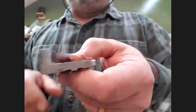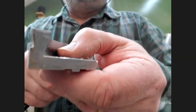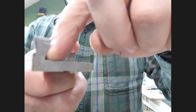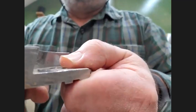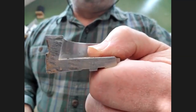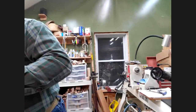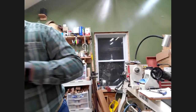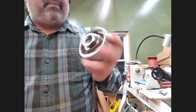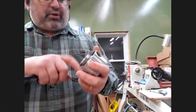That's different from other jaws they sell — like this one has a dovetail on both ends. For this one you want to match your tenon with a dovetail to match that angle — I think it's 15 degrees. And cut the outside mortise to match that dovetail so you get a good hold.